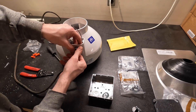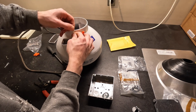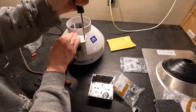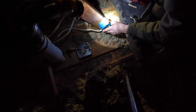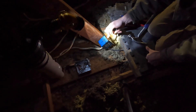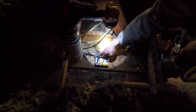I wired the fan up with a cord I had around that I previously cut off some old appliance. It's a three-prong but the fan doesn't have a ground, so I just wired black to black, white to white, and left the ground alone. The outlet in the wall is fed from the attic, which gives me a cable I can splice into for an outlet in the attic to plug the fan into. The smarter way — and what I ended up doing — was cutting the Romex and running one piece up to the new outlet, then from the new outlet running a new section of Romex to meet the other half of the existing wiring, and wire-nutting them together in a 4-inch box.